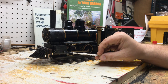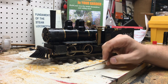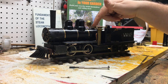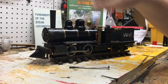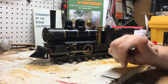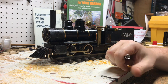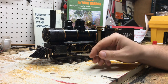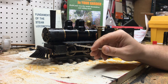And he said that the O-rings in this cylinder were worn, and I said, maybe, because what's happening is you'd have pressure, you'd open up the throttle, the steam would go hissing down, you'd see plenty of steam coming out, but, as Dave Ramsey says, kind of big hat, no cattle. So, it wasn't really doing anything. It was just making a lot of noise and making a lot of steam. And steam should only be coming out of the stack when this is working, not sitting static.